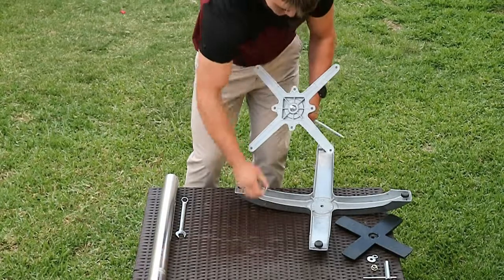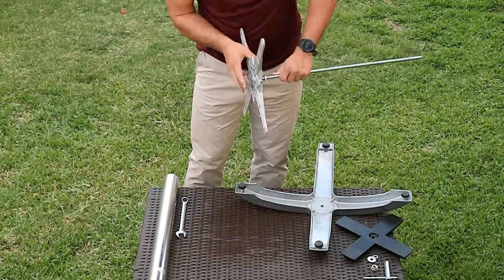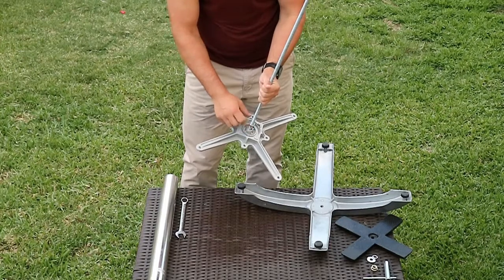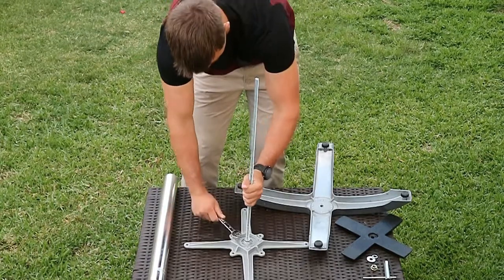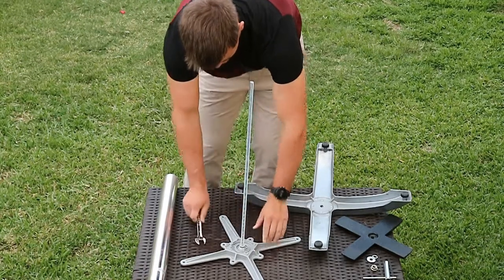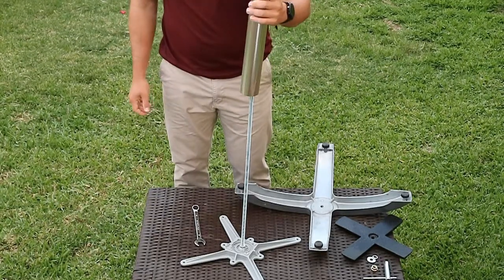Step 2: take the top cross plate and push the threaded rod through from the underside until there is a portion sticking out the other side of the cross plate. Step 3: take the second narrow nut and wind it on until the end of the rod is just level with the top of the nut. Drop the rod down so that the top nut is firmly seated in its hexagonal housing. Step 4: firmly fasten the lower nut hard against the top cross plate and tighten with the nut tensioning tool or a spanner. The threaded rod should now be held firmly in place.